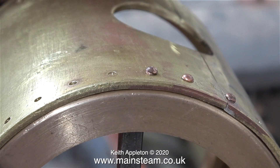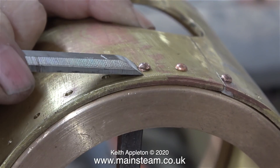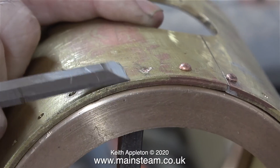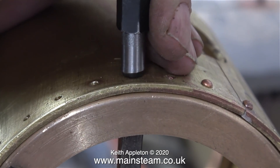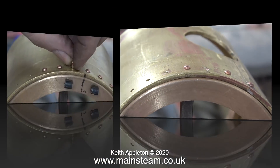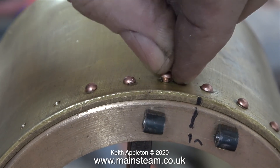Please don't write in to tell me that I'm doing it wrong, I do know this. And please remember, experts, you are watching a tutorial designed for beginners. The rivet is a thorough mess so the best thing to do is to remove it using a sharp chisel. I'll come back to this and remove what's left of the rivet in the hole and then re-rivet that particular one.